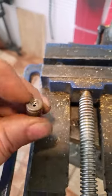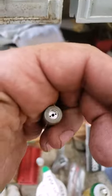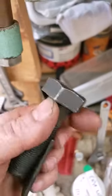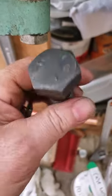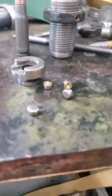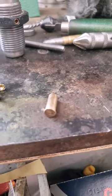Some guys buy copper tube like this, usually 1-1/8 inch, but you don't need to do that. All you need is some .22 long rifle spent cases. We're going to press a .22 long rifle spent case into that primer cup, because Berdan primers are actually wider in diameter. Regular large rifle primers are actually a smaller diameter, so we need to make up the distance in that space using a spent .22 long rifle case.